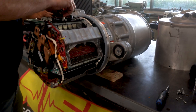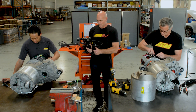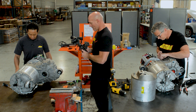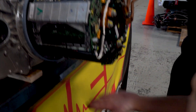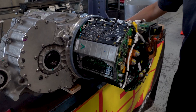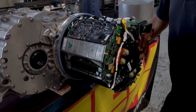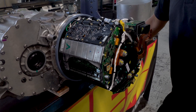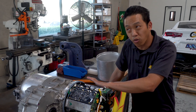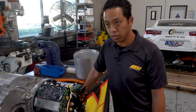We talked about a capacitor in here — let's expand on that a little bit just to be cautious. In here is a fairly large capacitor. We've got capacitor banks here, here, and here that store energy which gets delivered to the FETs that actually drive the motor. Capacitors are like high-discharge-rate batteries with a really small capacity. This thing can hold about 400 to 450 volts, and the amount of current they can carry is enough to possibly kill you or stop your heart.